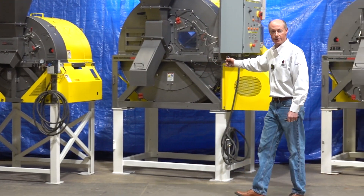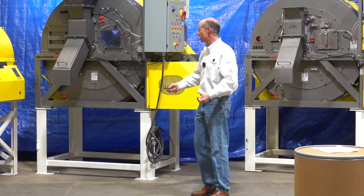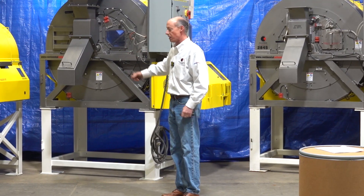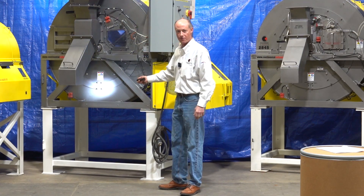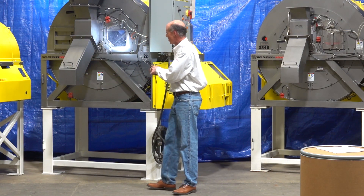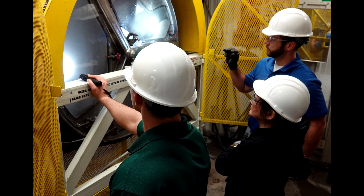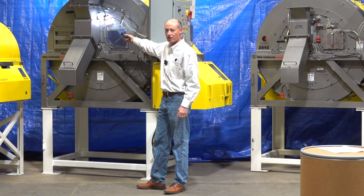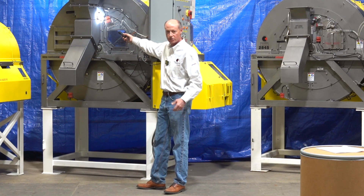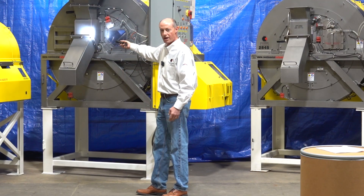Moving into the Mark 7-1 — if you're looking to coat powders and granules, and we know the flowability is such that it's better in a Mark 7-1, we might use this machine where again we're full at shaft center. We wouldn't use the whole drum for the fill product. Up in here you can see we have great visibility in our test mixers — we have windows in our machines so you can see the product being made. Here is our liquid spray port where we spray liquids down onto the product in a free-falling curtain, intimately exposing the surface area and adding liquids right onto the product.